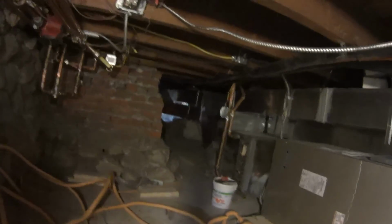We come up to the crawl space here. Ran from upstairs. We just have it stopping there. I did a lot of masticing. There's the condensate pump. Everything's masticed. No, not everything. I still have to get way down there. That's masticed. I need to get that little corner. This is all masticed. Everything behind that's masticed. Attention, service technician. While cleaning AC/heater filters, also clean the tank and check valve and the bottom of the pump. So the condensate pump, filter door. Put that on. There's a bottle of mastic.